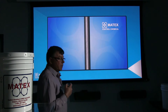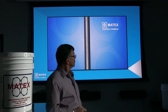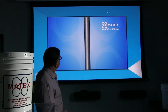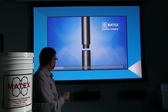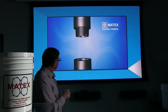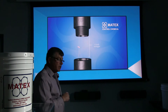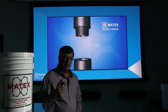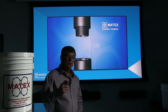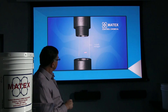How do we know how much product is enough, or how much is too much? I like to put this animation on here because it's easier if you see it. Every time you go to make a connection, if you have about an eight-inch stringer hanging out from your drill pipe, or at any connections you make at your top quill or what have you, then you should have about the right amount of injection per your rotation and per your penetration. So just look for that eight-inch stringer.